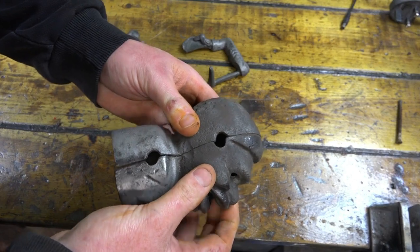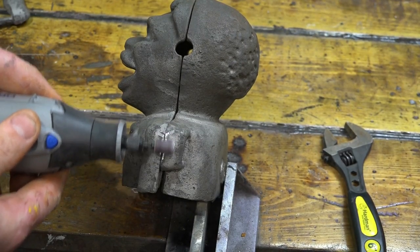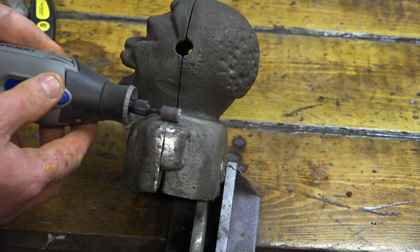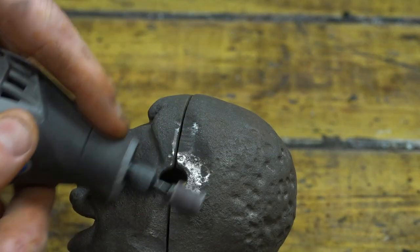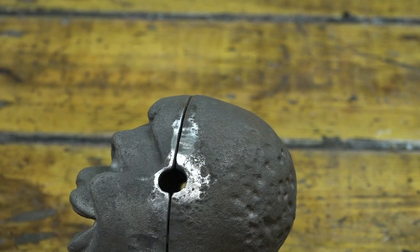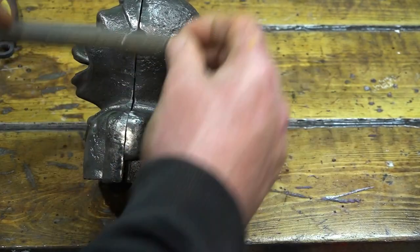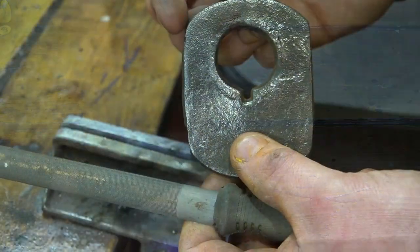Everything has come out quite clean and nice given the condition it was in. There are a few casting marks in the side where the two pieces meet, so I just decided to get my Dremel out and give them a polish and tidy up, taking any of the bigger pieces away - there were a few areas with quite a lot of marks. I just used my file to square the edges off and blend it in, so when you paint it you don't end up with bad lines in the surface.